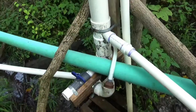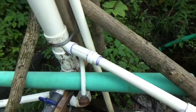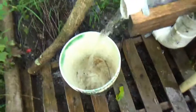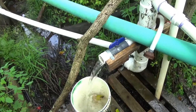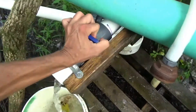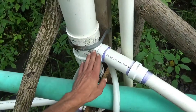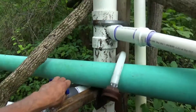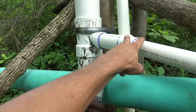I think I dropped it about 18 or 24 inches, but for some reason we're still having trouble getting enough water into the drive pipe for the ram pump. Yet when I open this bypass valve the water flow hasn't been too bad — you can see there's a decent amount of water flowing there. But when I close the valve, the volume and head pressure is not enough to supply that same volume of water to the drive pipe at this higher elevation.